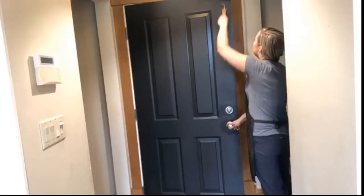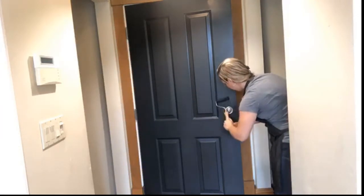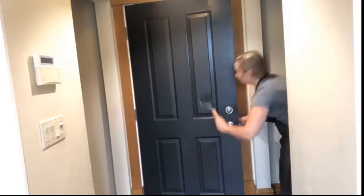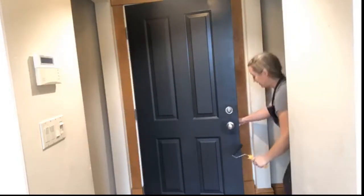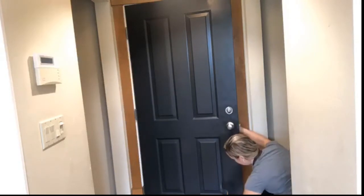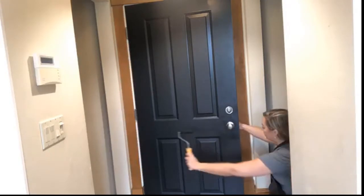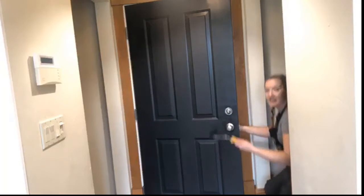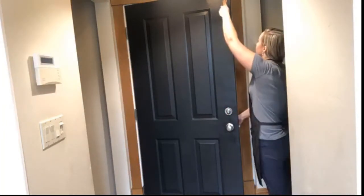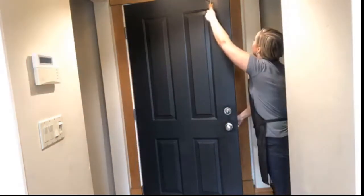You can tell where the paint is wet — it looks a little darker than when it's dry — so I can see where I've gone and where I haven't. Now to fix that area that looked uneven with the shiny and not-as-shiny patches: now that I have full coverage on this panel, I'm going to make my roller go all in the same direction. Instead of going up and down, I'm going to let it go all in one solid pass going down, overlapping just a tiny bit.